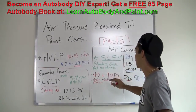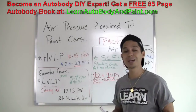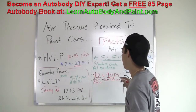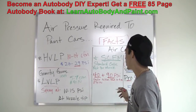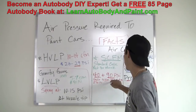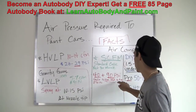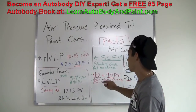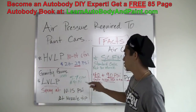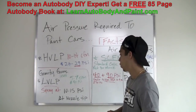SCFM means standard cubic feet per minute, and you usually gauge this at 40 and 90 PSI. If you check the spec sheet on your gun or air tool and it says it uses 6 to 8 CFM at 40 PSI, you know how much air it's consuming while you use it. Basic siphon feed spray guns and low volume, low pressure guns use about 5 to 7 CFM — or 6 to 8 CFM — at 40 PSI. This is a great number because it's low CFM; you're not using a lot of air and you don't need high pressure or high volume to get everything working correctly.